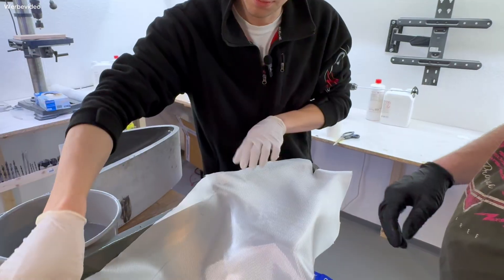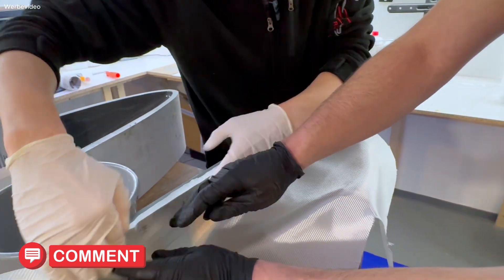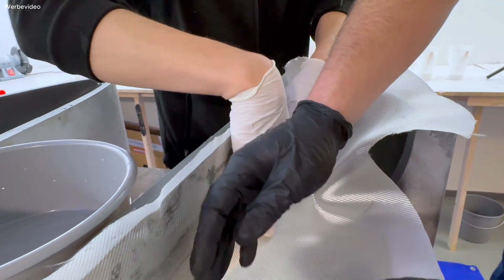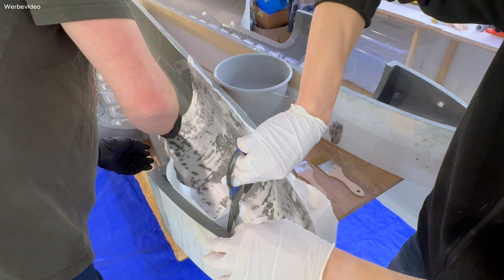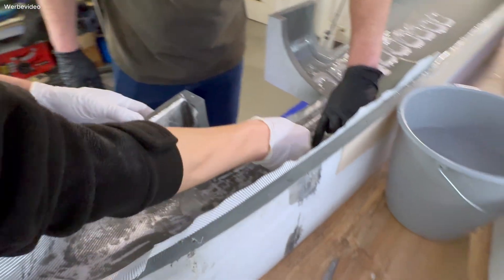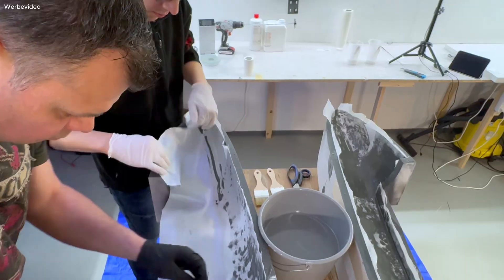There are many different methods for working with epoxy, carbon fiber, and molds — if you have any tips or tricks let me know in the comments. Even though I made templates for the fabrics, it's not always easy to fit the fiberglass to the needed area, especially on very round shapes like the very front of the fuselage. That's also the hardest part of the whole plane because the front curves very quickly. We also don't want any air trapped under the first layer, which would be the outside of the finished cast part.